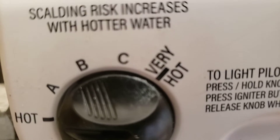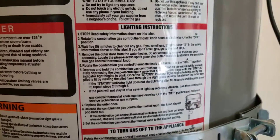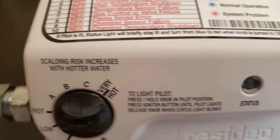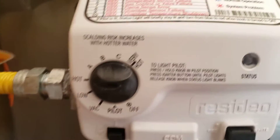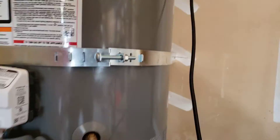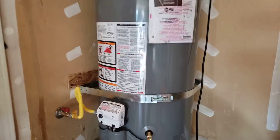Just be mindful if you do turn it up to generate hotter water — for example, to fill a big soaking tub. That'll help make it feel like a 65-gallon instead of a 50 just by increasing the heat, but you do run a risk. We leave it at 120 because we don't want to be liable for any problems with hot water. The burner is lit, so it should be a couple of hours before you have hot water. Outside of that, this installation is done.